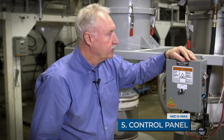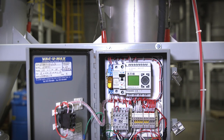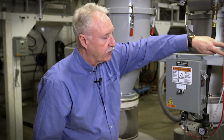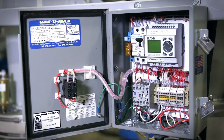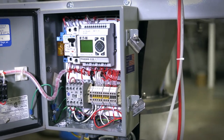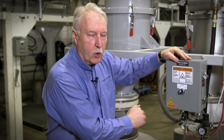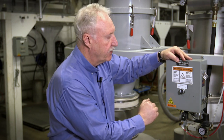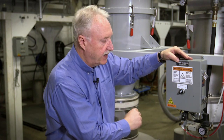The fifth part of the Signature Series is the control panel. This conveyor is driven by a Venturi power unit that operates off compressed air. It includes the manifold as well as compressed air tubing, which is numbered and matched to all the fittings on the control panel. It is a NEMA 4 enclosure as standard, operates off 120-volt single-phase power — also available in 220 single-phase — with a simple on-off switch to turn the conveying system on.